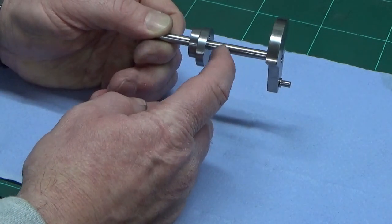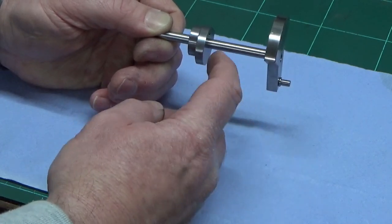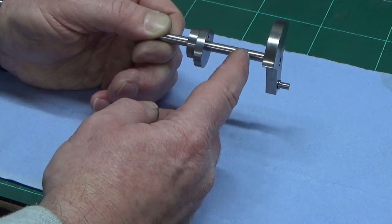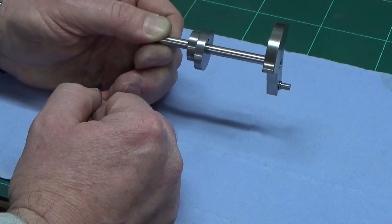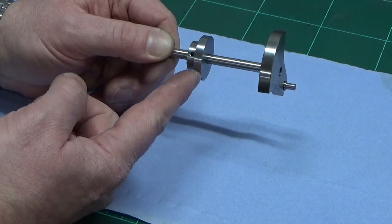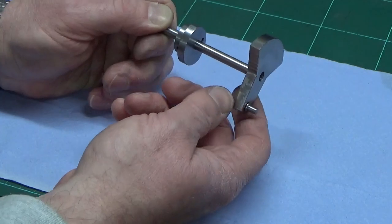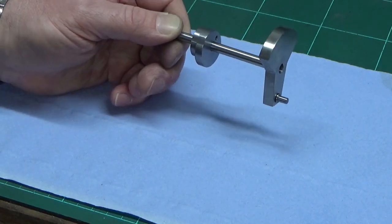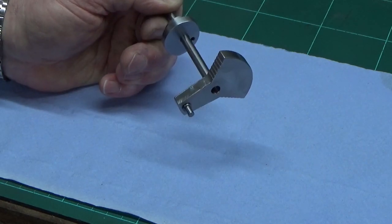I've got some brass spacers to make up, and again I'm not going to film those. They're just basic OD turned to a diameter, drilled and reamed through the bore to the 6mm OD of the crankshaft, and they're various different diameters. There's three or four spacers that I need to turn up that fit on this crankshaft, but I'm not going to film that. It's just basic turning. Seen it thousands of times on my channel, let alone everybody else's. So yeah, happy with that. Happy with the cam, the way that's turned out, and the crank web with my extra special weight reduction slots on it. So that's about the end of this episode. So what we'll do now is wrap this episode up and we'll think about what we do next.